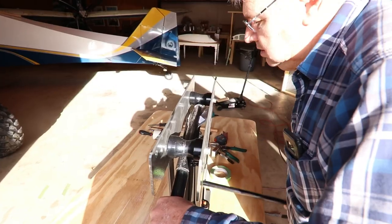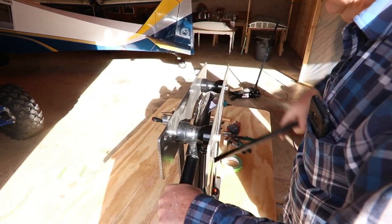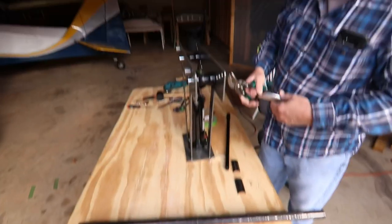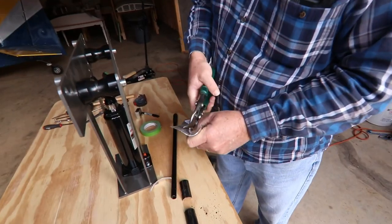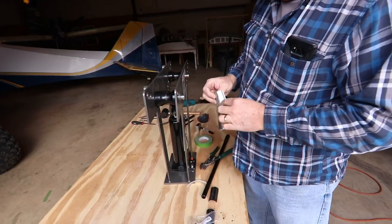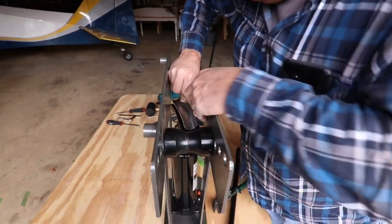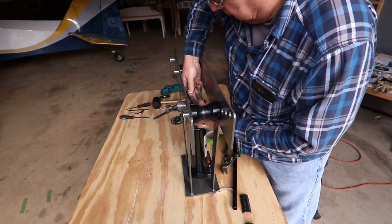It's the first time we've seen sun in three years. Okay, let's see what that looks like — there is our first bent piece. You just saw everything it took just to make that happen with this super-duper high-quality professional-grade equipment. We're now trimming the shim that was in there — it's much more manageable and not in the way of the markings now. That's actually pretty nice quality — a beautiful form-fitted die. The whole purpose of this is just to take up the slack in here. I'll turn it around for the next set of bends so it form-fits this side down in there.